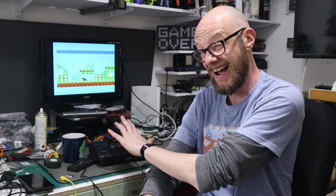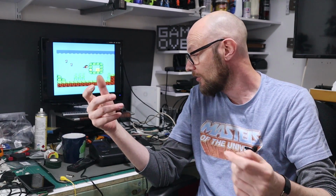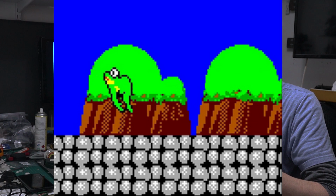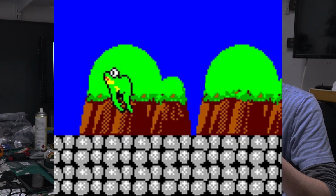I basically found my way through the dark with this. When I first started, I simply had it wired straight up to the CXA 1145 chip with some resistors and so on and so forth, and that was using a straight through handmade SCART cable. So then when I got these bought ones, it really didn't want to play the game. When I first wired it up just directly without any of the extra resistors and stuff, this is a quick photo here of what it looked like, and you'll notice that the green trees in the background are missing their kind of dark green shadow. When I then tried to put the 75 ohm resistors into the three RGB lines, it came good. So I was happy with that.